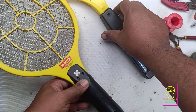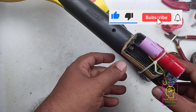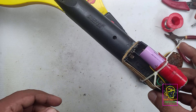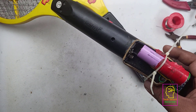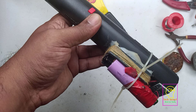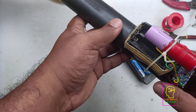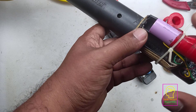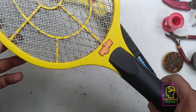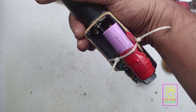You can see that this one is actually a big bat. This was a rechargeable bat with nickel cadmium cells. The cell became damaged within eight months of use. First what I did was convert it into a replaceable 1.5-volt cell by fixing the battery socket outside — I used that for three months. Later I replaced it with a lithium-ion rechargeable battery. I cannot remove the battery socket because it was fixed using heavy bond glue used for fixing metals, so I fixed the rechargeable battery on top of it using a wire tie, and I used a BMS for recharging. This bat has been working fine for the past three to four years.